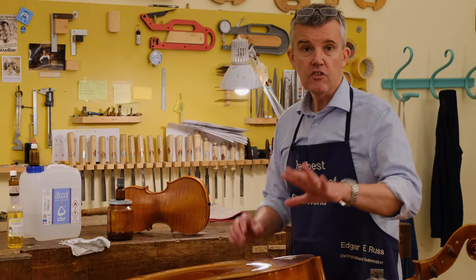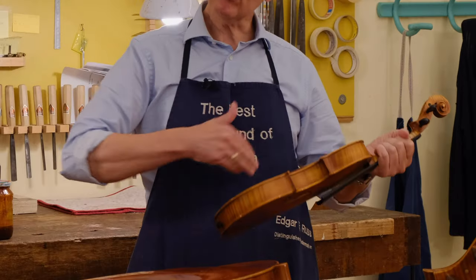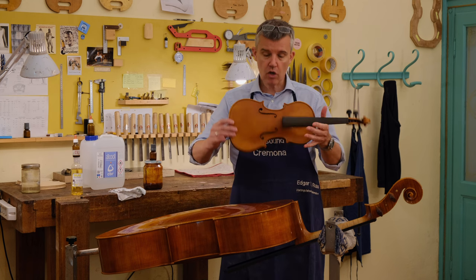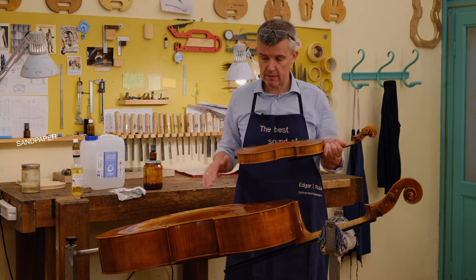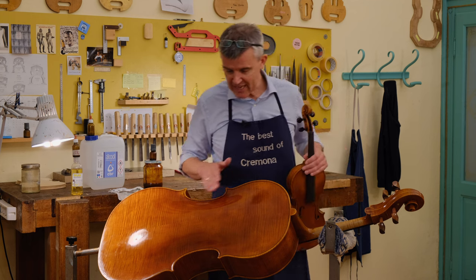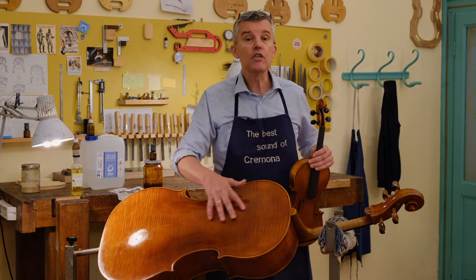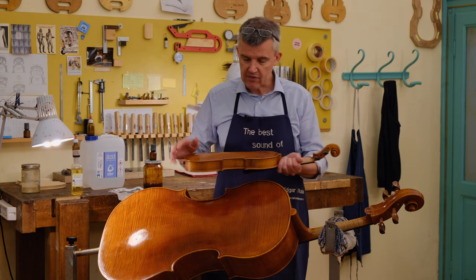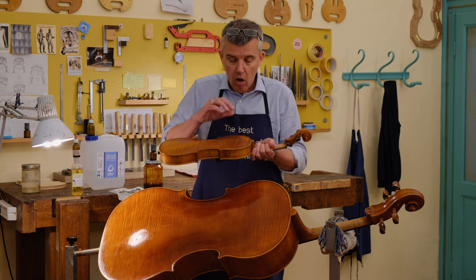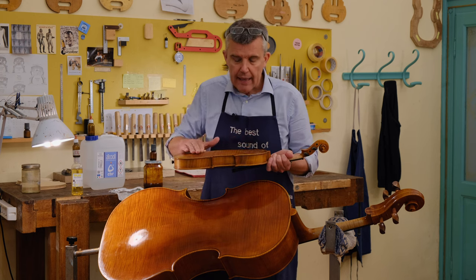Come on, this is just violin making. That means while we are varnishing and we put on one layer after another, and at a certain point when we have enough varnish on top of it, we sandpaper the instrument. To get it ready, you have different options. This one has been polished yesterday and we explained exactly how it should be done. And this is the result by now, which means that a sandpaper opaque surface after it has been varnished, all these tiny scratches have to be filled up with the varnish and polished.